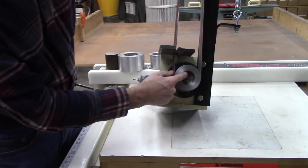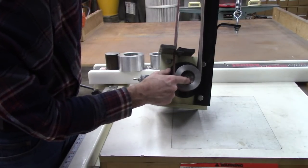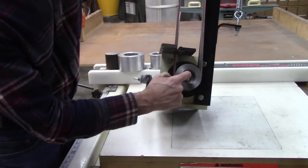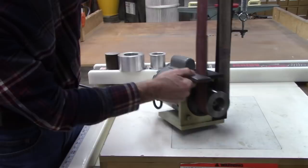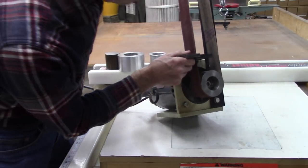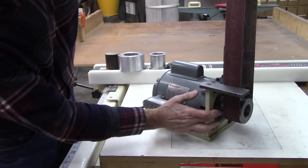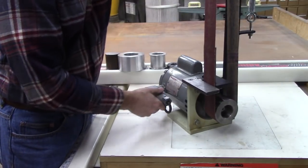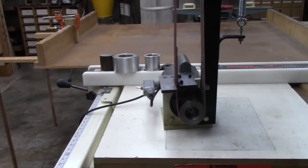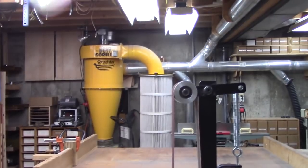And you'll notice that's real deep in there. It's a bolt-on or a nut threaded end on the motor shaft. That's how most of the pump motors are. But I had to make it real deep like that because the shaft is short. It's probably only about maybe 3/4 inch of the shaft is in that pulley. But this should work. Steel's good. Should hold up good.